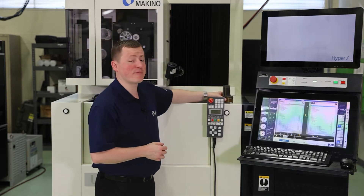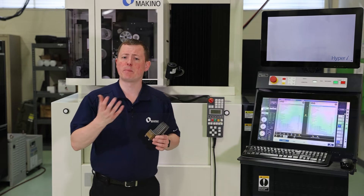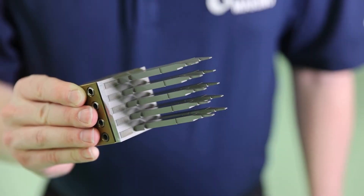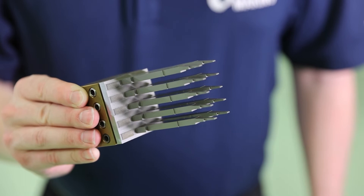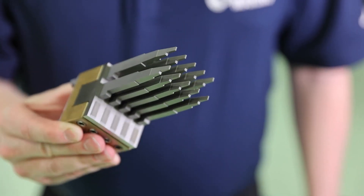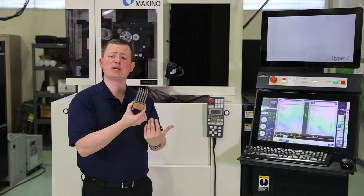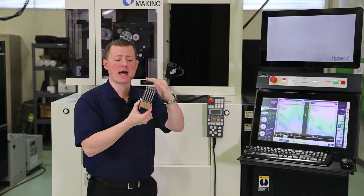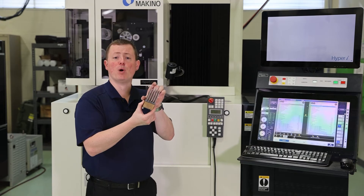Another way — if possible, depending on the material and the shapes you're trying to cut — is that cutting from the outside and machining all the way through will cause movement. If you have a lot of that movement and plus-one isn't available, or you're trying to machine faster, what you can do is leave extra material out on the end and tag the material on both sides.